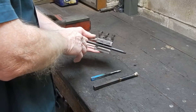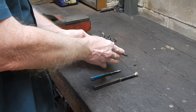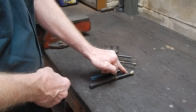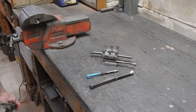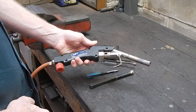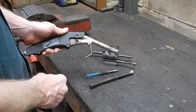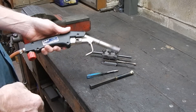Here's actually a commercially made one — I did lie, I have got one. That actually came with my little old Southbend. So it's the only commercial boring bar I actually possess; all the rest are all just built up. If you want to make a boring bar where you are hard bronze brazing on the tip — all these three are all hard bronze brazed on — you have to have either an oxy-acetylene set or a gas gun like this. This is the Bullfinch auto brazing gun. There's a link in this video to this particular gun. They're not cheap but they work great and they can do hard bronze brazing which other LPG guns can't really.